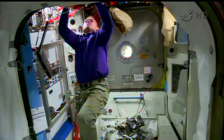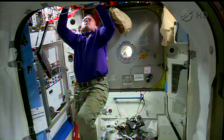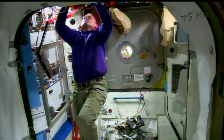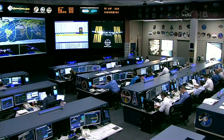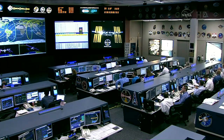Meanwhile, Gerst was setting up and strapping into the space station's robotic arm, setting up the articulating portable foot restraint. He was then flown by Expedition 41 crew member Butch Wilmore, who was working from inside the Destiny laboratory at the robotics workstation, up into the POA, where the failed pump module has been stored since it was taken out and replaced last December 2013 during 2 EVAs by NASA astronauts Rick Mastracchio and Mike Hopkins. Once he arrived, Gerst was able to detach the failed pump module from that payload ORU accommodation unit, back away on the robotic arm, rotate it 180 degrees, and then took a ride across underneath the International Space Station on the end of that robotic arm, again being flown by Wilmore.